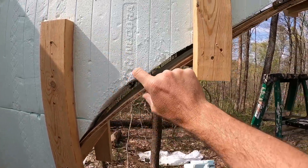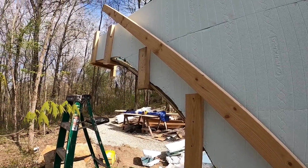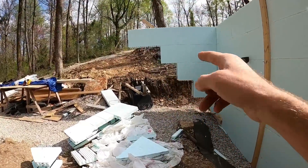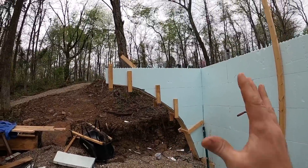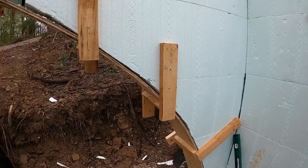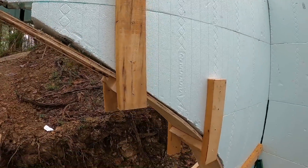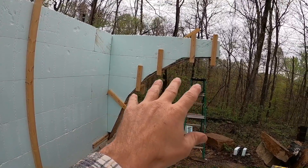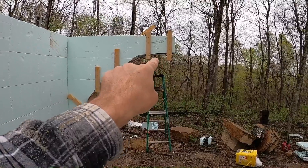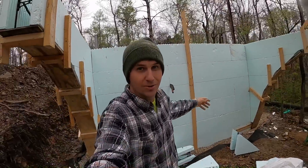On this side we're going to try a lot harder to make it look nice and tight like it's supposed to. The good news is I can measure down to where the plywood's at and have a better measurement. This side turned out way better — still had a little chunk missing where the corner was, but the spray foam will fill that in. It definitely looks better than whatever happened on the first side. The important thing is the plywood has the same overall shape — the bad cuts are throwing off the clean lines, but when we put the exterior finish on and it's full of concrete, it'll all look great.